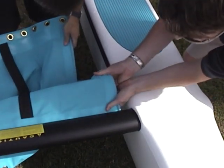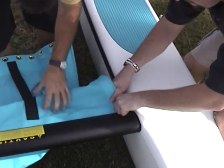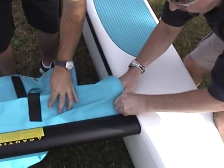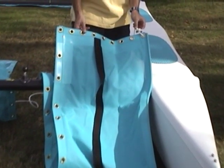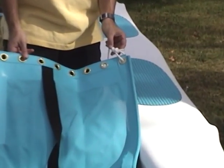Be sure that the hulls are seated tightly against the crossbar stops as shown. With the hulls seated firmly against their stops in the crossbars, pull the trampoline outboard until it is flush against the hull. Feed the main trampoline halves — either port or starboard first makes no difference — into the side tracks.